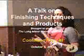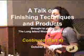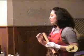Where you would use oils. Oils are particularly beautiful on cherry and mahogany and walnut. Where you have a beautiful grain, you really want to use an oil because it really enhances the grain.